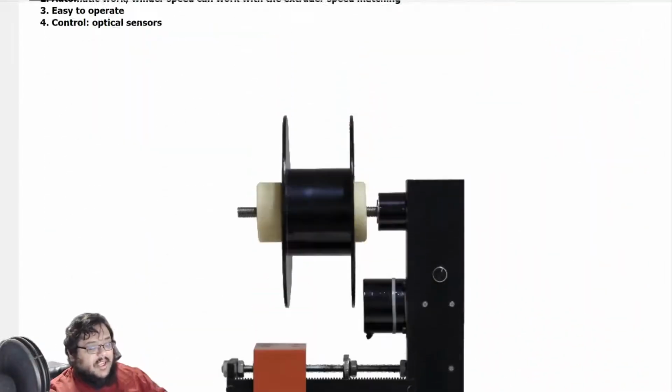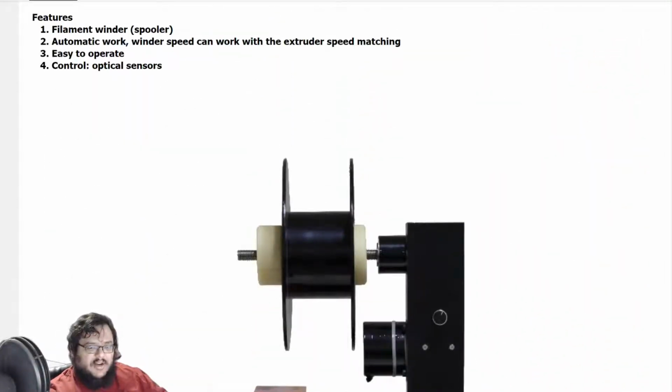And then on top of that, the pellets that you're going to grind are going to be jagged, and they're not going to feed very well. So the common practice in the industrial settings is to mix a certain amount of recycled bits of plastic with virgin plastic. In other words, plastic that has yet to ever be extruded into a filament.